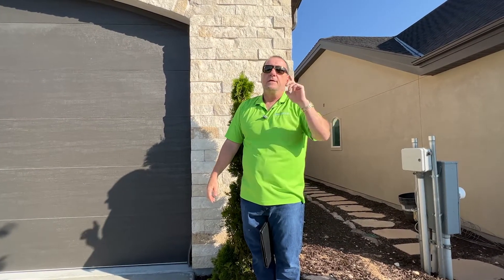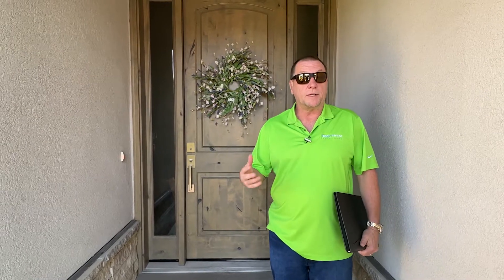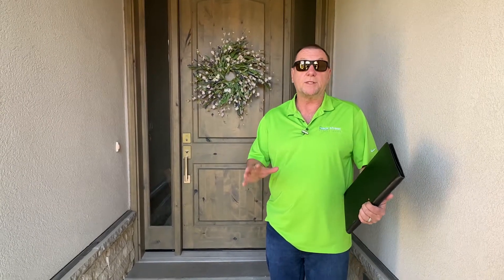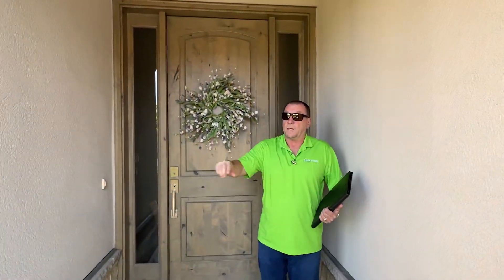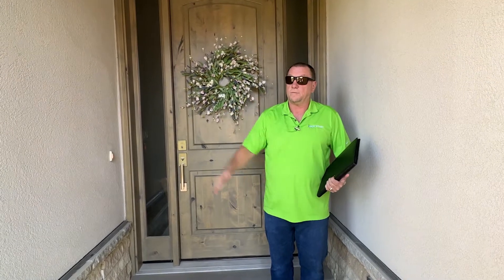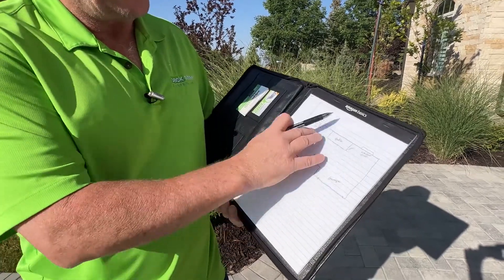I'm not worried about someone coming up behind me because we're not done with the design. The next location to consider is the porch area. The client mentioned they want two-way communication to be able to communicate with people that come to the door — that idea replaces the ring video doorbell. You put the camera up here in the corner and we're going to use this corner because it covers the porch area and gives us a view into the front yard. I carry a binder with me and I did a quick design of the house — it's really technical, but the point is I understand this design.